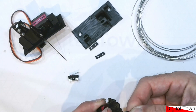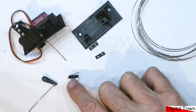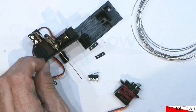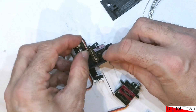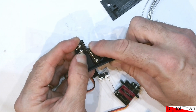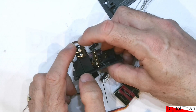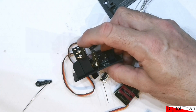This piece goes on the front of the servo. If you want the turnout to also control the polarity of the frog, then you are going to need the microswitch — this is optional. As you can see, it is adjustable. As the servo turns in one direction, it turns the switch on; going in the other direction, the switch is turned off. There is one contact that will go to the frog, and then contacts that go to either side of the track depending on the polarity.